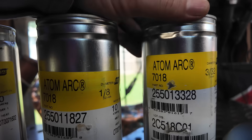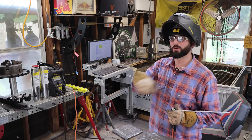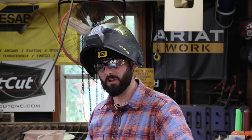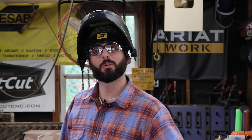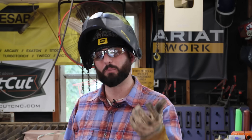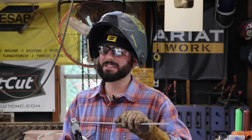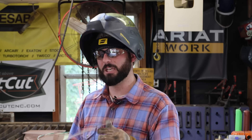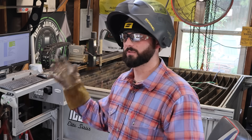In this instance, a flat piece of plate with a 1/8 7018, 125 amps is going to do the trick. I can do that over and over in this flat position, even on a quarter-inch plate. But if I put that plate in the vertical position, it's likely I'll be able to dig a hole to China. If I move up to one-inch plate thickness, we can make it because that material holds more heat and more amperage. Same thing with rod diameter — if the rod is smaller, you need less amperage. And if the rod type is different, 125 amps with a 7018 might be perfect for flat, but if I change to a 1/8 6010, 125 amps is going to be very hot. All these things are situational and circumstantial depending on those variables.